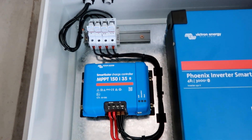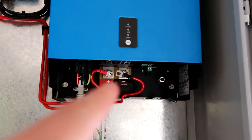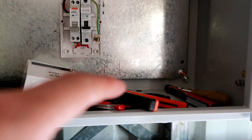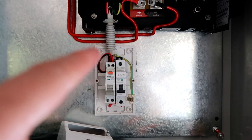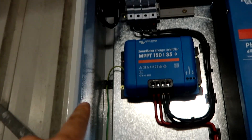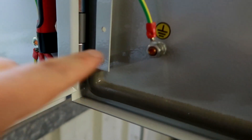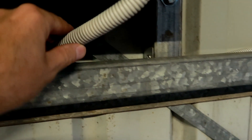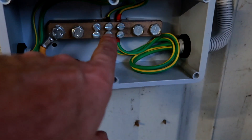I think we have everything done so far. Fuses, cables to the solar charge controller, PV input, and from there positive and negative going down to the terminals of the inverter - now just waiting for the battery cables to connect, and then we can turn everything on. We are close. I've also done all the ground cables to the charge controller, to the inverter, to the doors - all going into a conduit which will be mounted, and all connected to our main ground or earth bus bar here in the off-grid garage.